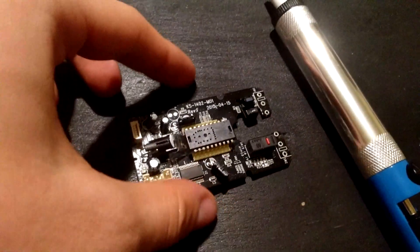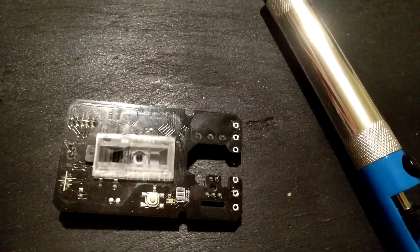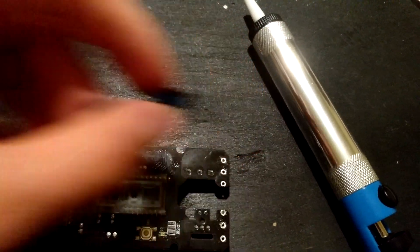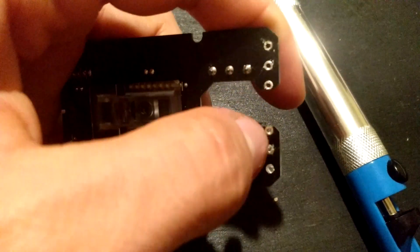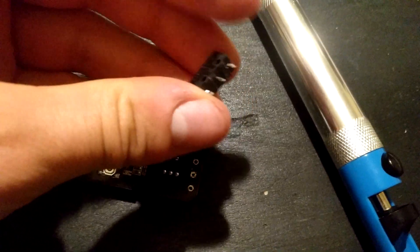This is how the PCB looks after you removed all the solder and gently jiggled the switches out, because these will not fall out. You have to jiggle them a little bit, but just gently. Keep removing the solder until you see empty space around the pins, even when you have them in.